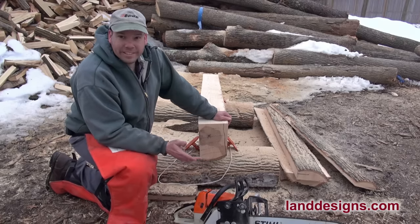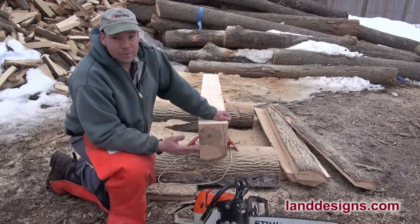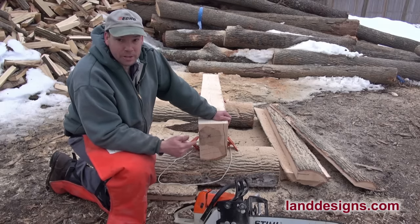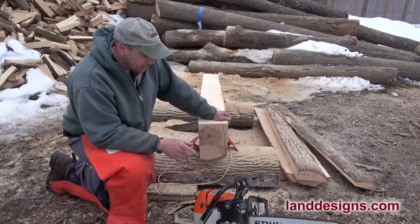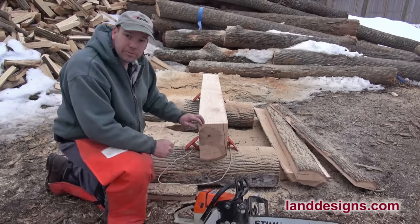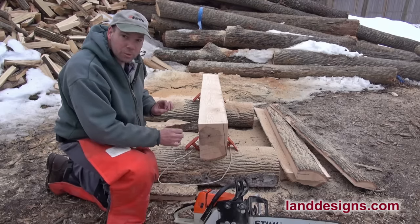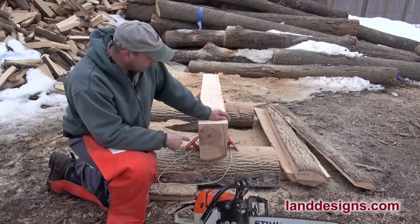I think I said in the last video, I've been having a lot of fun making this video. I'm still having fun. I'm still feeling pretty good about myself that I had a saw chain that wasn't cutting, so I sharpened another one a different way and it cuts. And along that line, when you're feeding the saw, you don't want to push too hard. The first cut or two I made, the saw was really bogging down, and you just want to push a little bit and let the saw do all the work. And you'll notice the RPMs are higher, so that was another thing I've been learning.